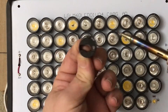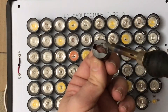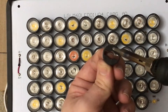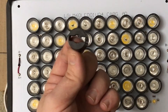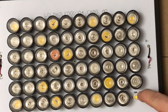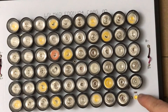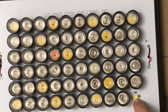It might be easier to do it another way, but the easiest and safest way I found without breaking this was to use a soldering iron with a set tip and melt this part. You can go all the way through or just melt to a certain depth. The reason you have to modify this is because all these better panels — whether from Mars Hydro or any other company — have this little chip in here. Basically what it does is when one of these LEDs overheats, burns out, or stops working, this keeps your panel still working by letting the power continue through even though it's no longer going through the LED diode.